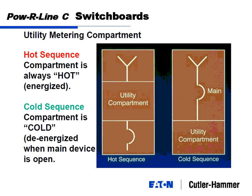And anybody want to guess why that probably is? Think about it this way. If you open that main, or if you double tap off the lugs here, anything here is not being metered. In other words, the customer's getting free power. Versus here, anything the customer does, he has to pay for. That's my theory.